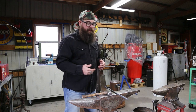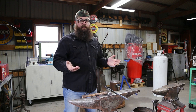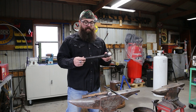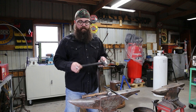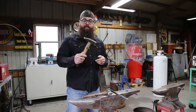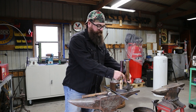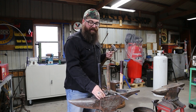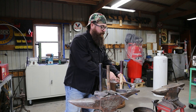I try not to use too heavy a hammer. I do have some four-pound hammers but typically I only use those for about 30 minutes out of an entire day. Most commonly I use a three-pound hammer — one I've dressed the way I like with a redone handle, one of my favorites. I also use a one-pound cross-peen or ball-peen hammer. These are my go-to choices unless I need specialty hammers like a vertical peen or straight peen, which I've covered in other videos.